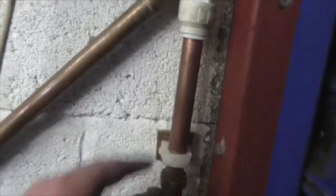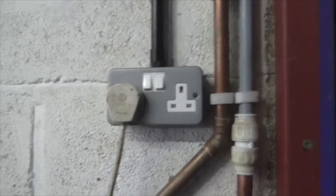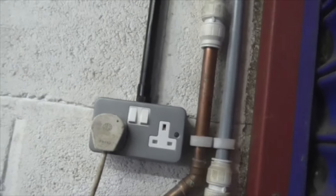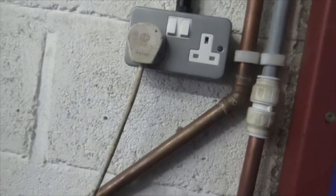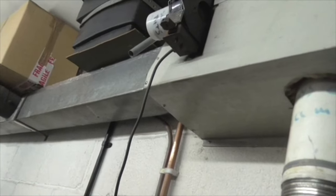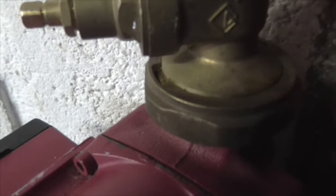Right, well, as you may be able to tell from the water all over the place, I have taken the pump off, taken this pipe off, blown compressed air up there, taken this pipe off here, let it all come down there. Now, there was at first resistance, and then the resistance disappeared and a load of water came out. So whether there was a bit of PTFE tape across one of the outlets and I've popped it off or not, I don't know. But it seems to be pumping better, because when you turn the pump on initially, it actually over pumps a little bit and you hear the water run into the tank. But it's still making this, can you hear that?